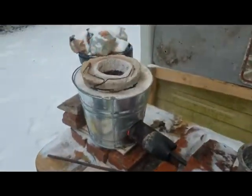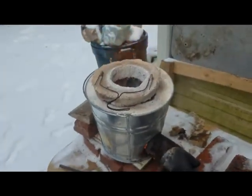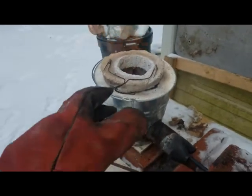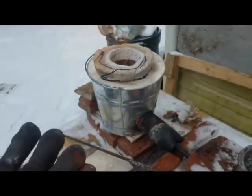I've got to make sure I have enough aluminum, because you get one shot at casting. If I don't have enough aluminum to cast in there, I've got to throw it back on the floor to melt it down and start over. You cannot put some aluminum in a mold and then do a new batch and top it off, because the aluminum will not bond to itself if it's already cooled.